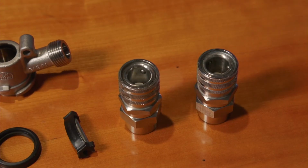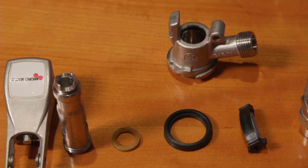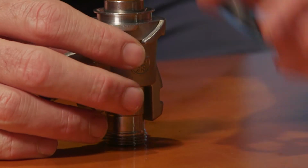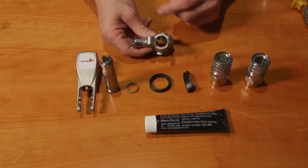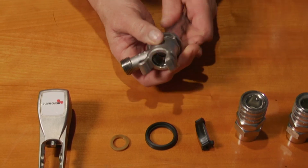Once it is all apart, you want to clean all the parts with an alkaline solution, ensuring you have the correct PPE for the task. When it is time to reassemble, start by fitting new O-rings to the inside body and main gasket. Make sure you give a little lubrication inside the coupler body, again with food-grade lubricant.